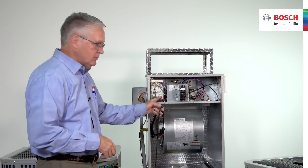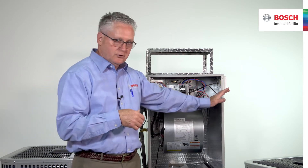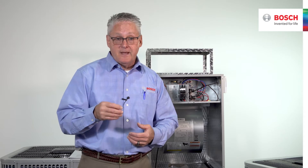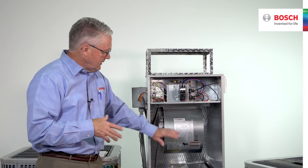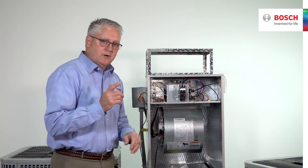We do not do that anymore with this air handler. This particular wire is tied to the board and a sensor. When the heat pump comes on through the controller, the fan motor does not come on until it recognizes a coil temperature of basically 95 degrees, keeping the fan off during that cold blow situation. This item is called anti-cold blow, and this air handler has one built in.